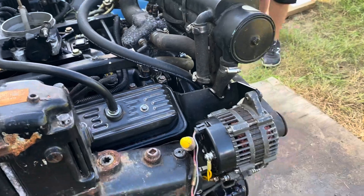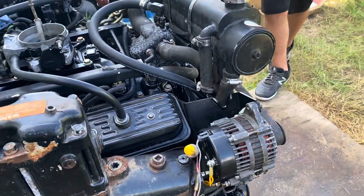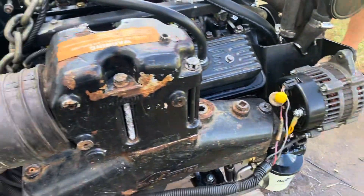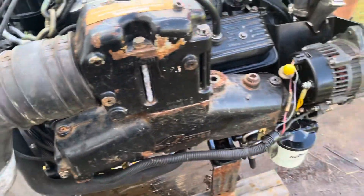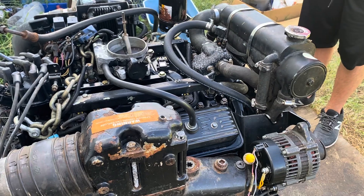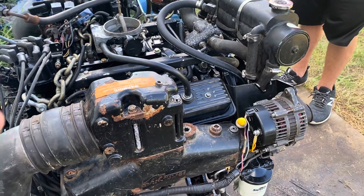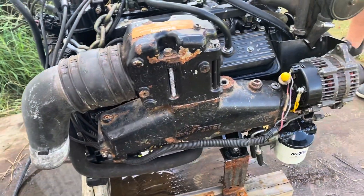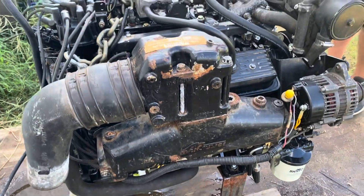That's how your closed cooling system works on a MerCruiser — it's pretty neat. If I had a boat, this is what I'd want. You still run a little bit of risk of having water sucked back into your engine since it still dumps into the exhaust, but this eliminates a lot of problems with inboard motors because you don't run the risk of freezing since you run antifreeze. You only run the risk of freezing your exhaust if you don't winterize, and exhausts are a lot easier to replace than the entire engine.